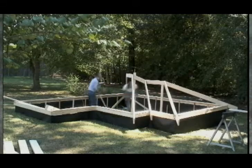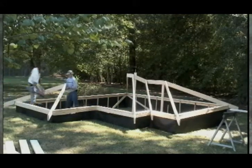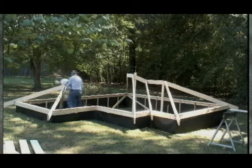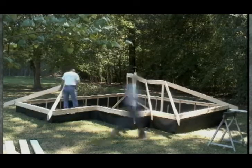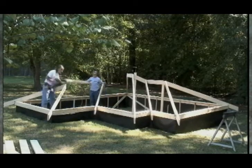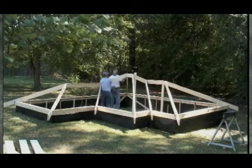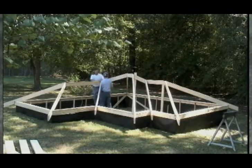You'll notice I have several vertical support members to stabilize the structure while the assembly is underway. Although the structure itself is somewhat self-supporting, sections where the ridge is interrupted on a short hip climbing to another ridge must be supported to hold the members at the proper angle and keep ridge members level.